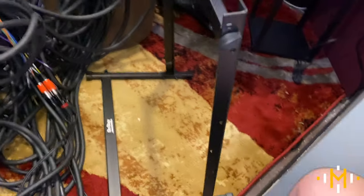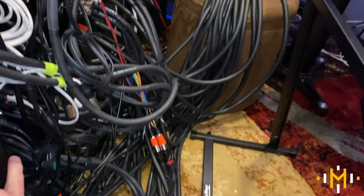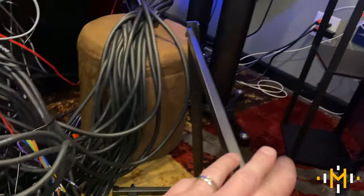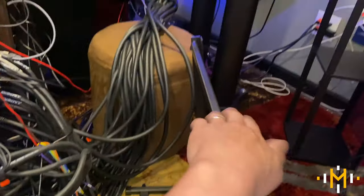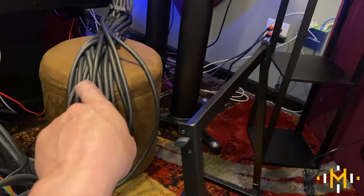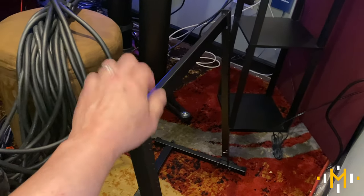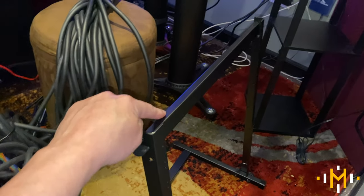What I'm considering is taking this rack, picking up all the cables, and sliding it under one of the racks — because the racks are off the floor on wheels, there's plenty of room underneath. I'll slide this under and have all the D-sub cables come over the top. If you can envision it, the big trunk of cables comes up over the top of this or into those channels on the wire management piece, and then gets cable-tied to this top bar — which is all steel — taking the tension off.